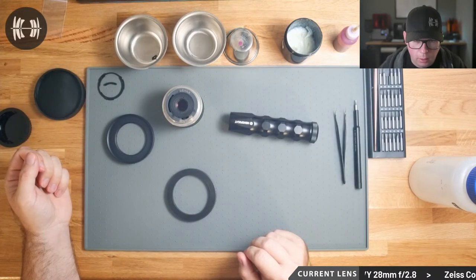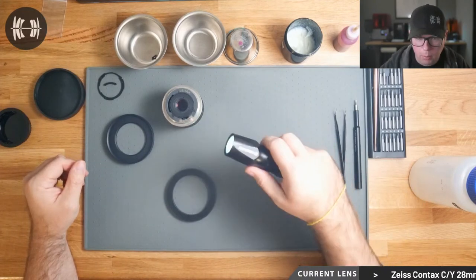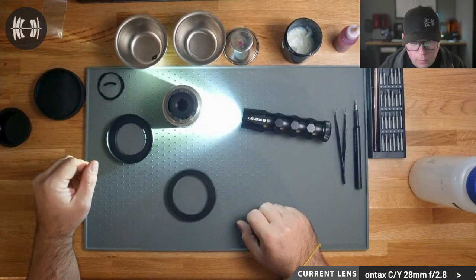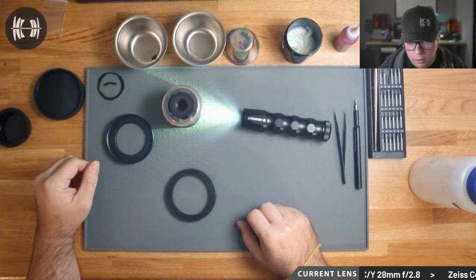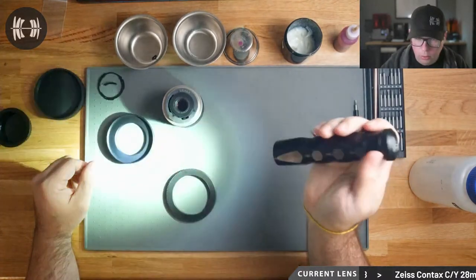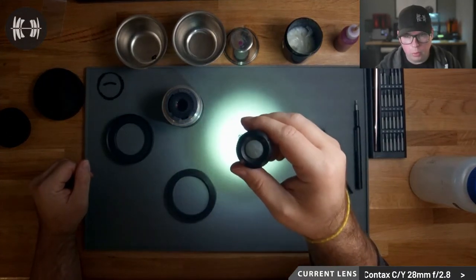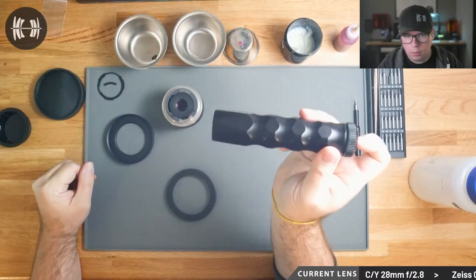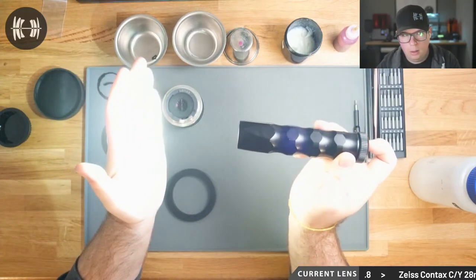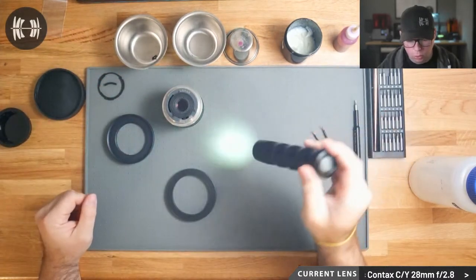When I'm working on something, I don't have to worry about the battery just dying. So when I come back to my bench and I want to work on it again, I just pick it up and it turns back on. I just leave it and it always shuts itself off. For normal mode, just one tap, it turns on, and with the accelerometer, basically straight down is 0% and straight up is 100%. So if I hold it at 90 degrees, that's 50% power. If I point it straight down, that's 1% power, and it's super dim.